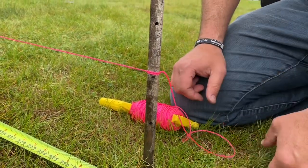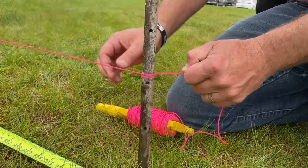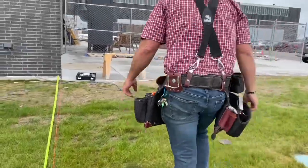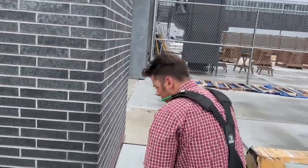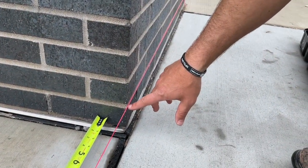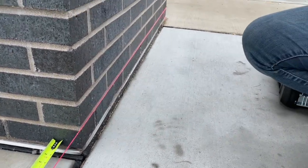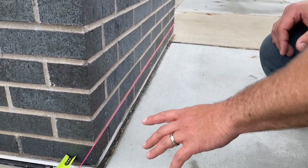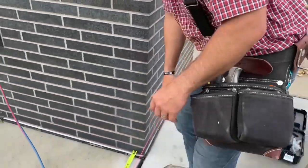It really helps to have stakes with some grit on them — meaning they've got some concrete on them already — so you can pull this very tight. Looking at the height: I can see I'm down into the bottom of the bed joint here, and where the string line is pulling over there, I'm at the top of the bed joint. I would need to raise that up until I'm even here, and then I've got a line that is level with the building — a level line.